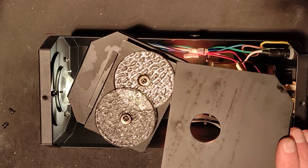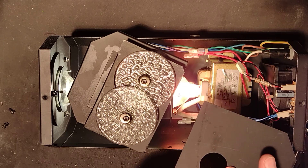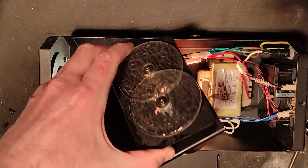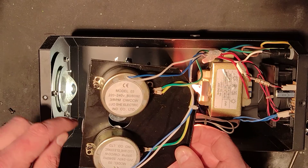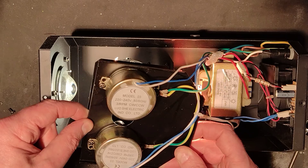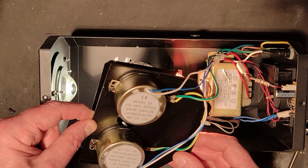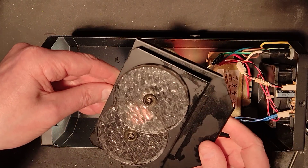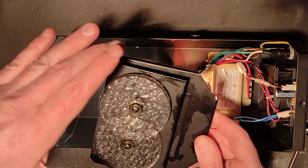The first thing that happens is the light shines through this baffle plate, which blocks a good section of the light coming through — so it has to be a narrow beam lamp. It then goes to the dual motor assembly, and the light has to find its way through one hole, then behind it there's another hole again. By the time it gets there, unless it's a very well focused lamp, most of the light is wasted before getting to the lenses. It gets splattered about and then has to go through that tiny lens at the front. After it's been through the glass, it's not an efficient light.